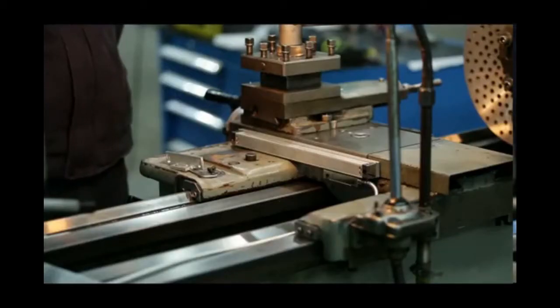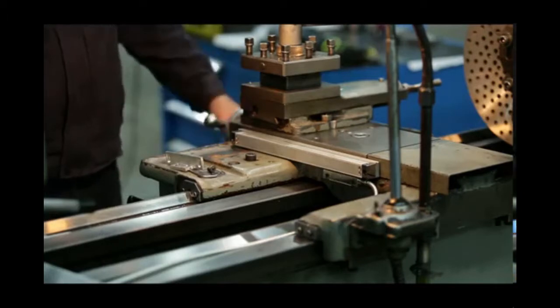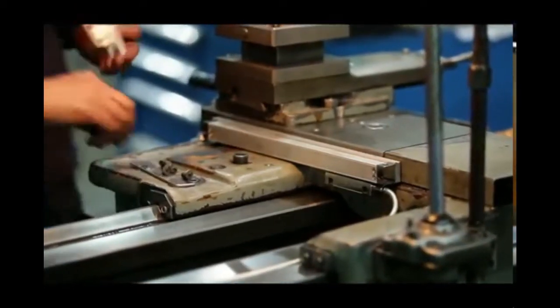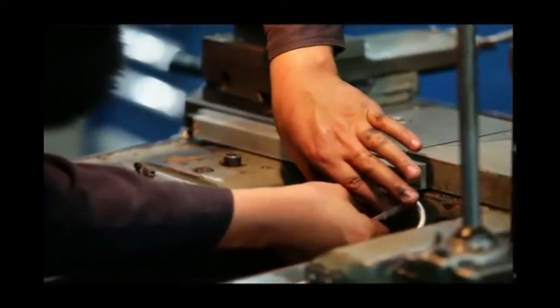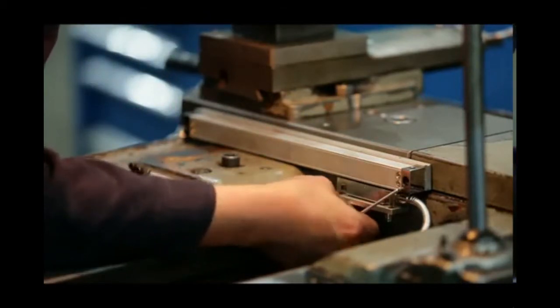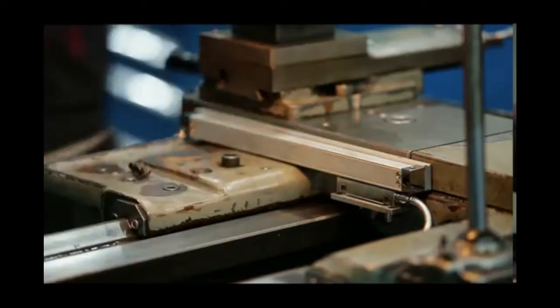After calibrating the parallel of the pad strip, we install the linear scale onto the pad strip. The next step is to install the readhead. Turn the table to one end and leave about 20mm extra length from the end cap of the linear scale to the readhead. Now we can fix the readhead onto the machine. Since the standard brackets we offer are not suitable for all installation situations, we have machined a custom bracket. Fasten the screws.